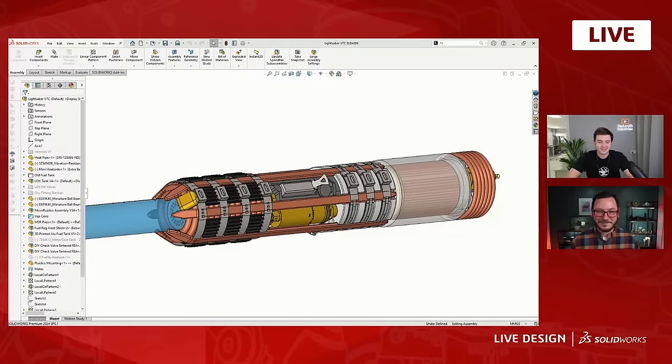Some of these tips and tricks allow us to get the design done quicker and have fewer errors in both manufacturing and engineering changes. You guys actually built this thing and you're using it to do real lightsaber things — it's not just a pretty model. Basically, our lightsaber is a glass-blowing torch at the heart of it — a nozzle that uses laminar flow to mix oxygen and propane at the perfect ratios to get a beam that's about three feet long and four-and-a-half-thousand degrees Fahrenheit.